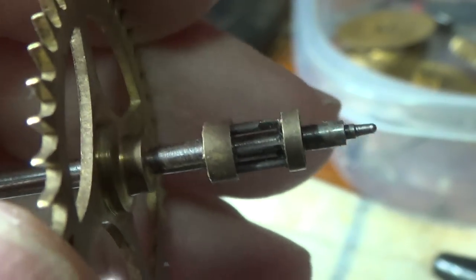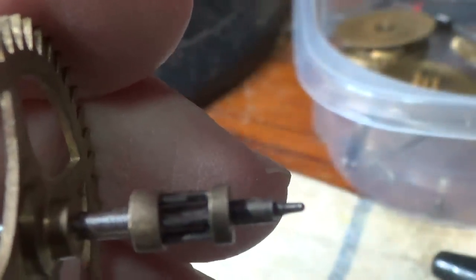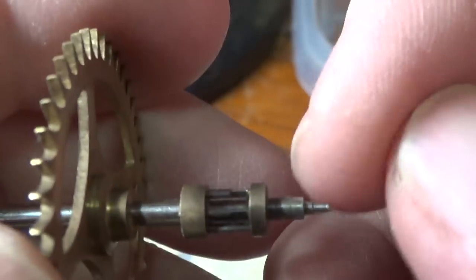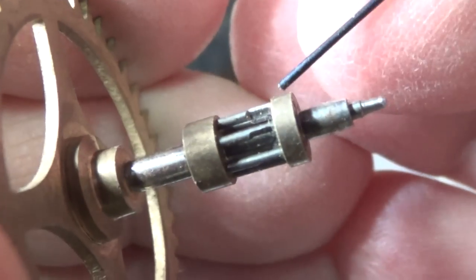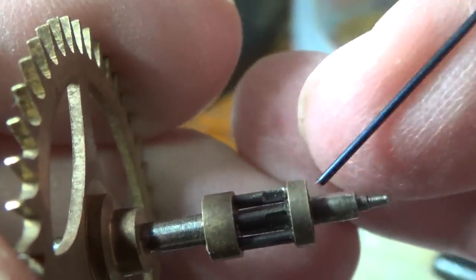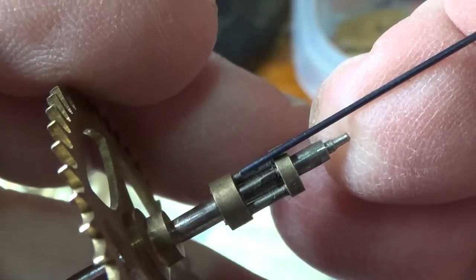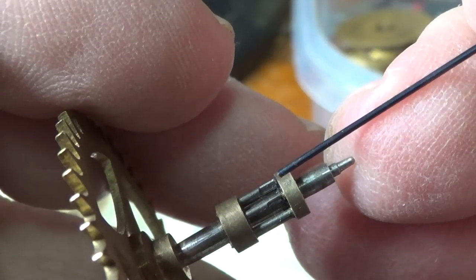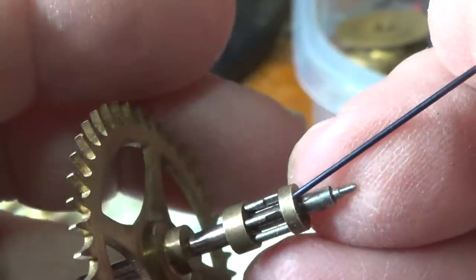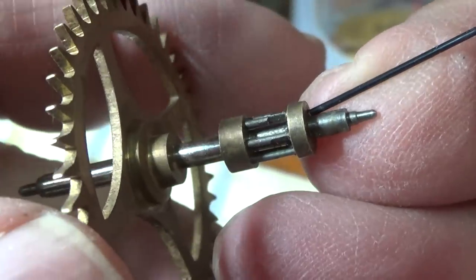And in replacing the trundles, some people use a puller, and they'll pull a shroud off the end of the shaft and lift the pins out, the trundles, cut new pins and put them in here, and then try to push the shroud back on and fit all the six pins into the holes. Yes, it's okay if you can line them all up.